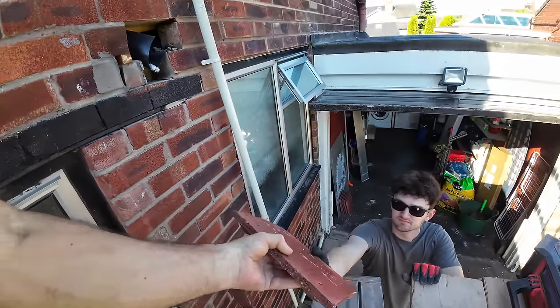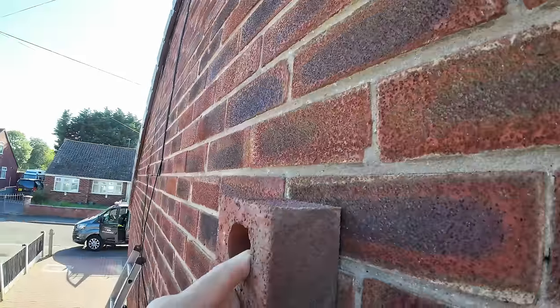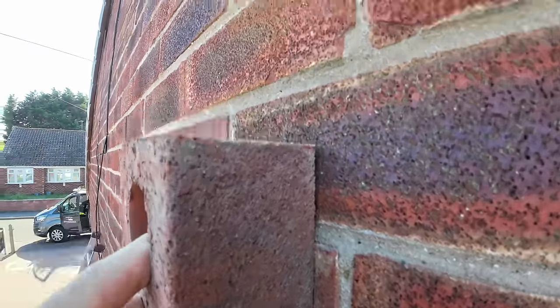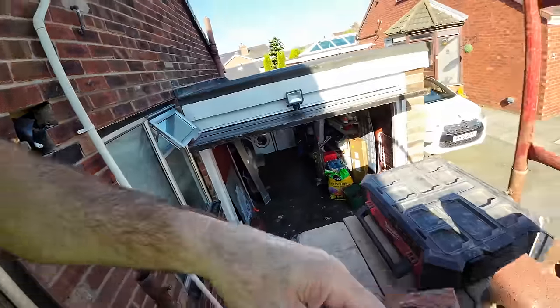The reason they're putting is not really for the drip, is to course the brickwork back in, because as you can see, soldier brick don't work with 73mm brick. So once that's in, the tile crease goes on top of that and it brings it back into bond. Gauge.